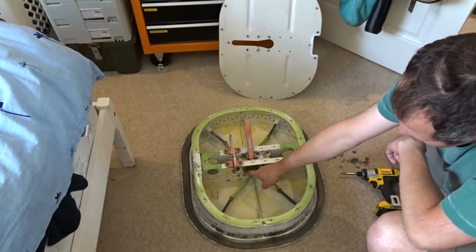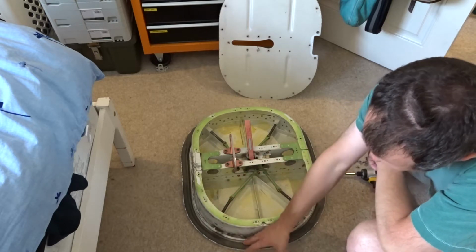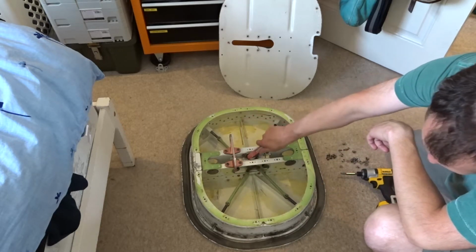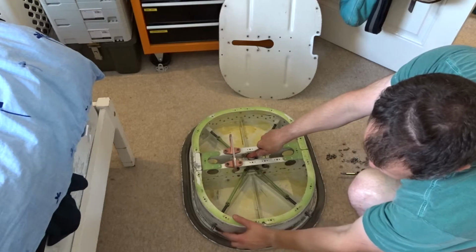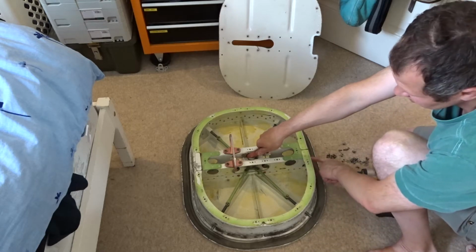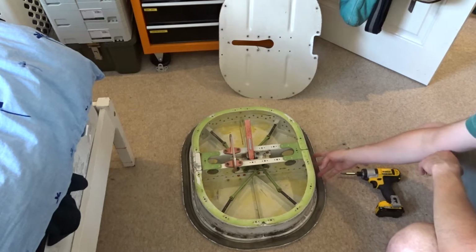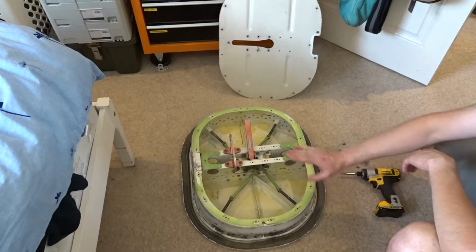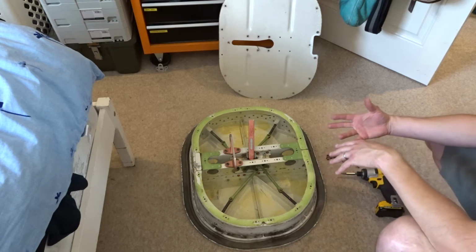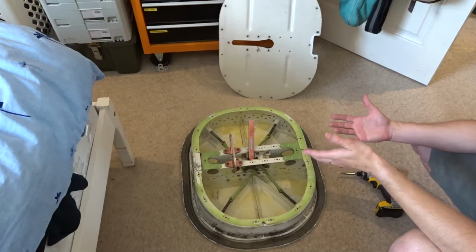It has a cog mechanism here which pulls on all of the 4 struts, and these struts are like safe doors. So once you've closed the actual door, the rubber seal will seal it. However, this will also go into the fuselage of the aircraft just for extra locking. In the past they didn't used to have that, they used to have a single catch, and unfortunately there've been a couple of aircraft accidents where the cargo door has been detached and has caused a decompression. So nowadays they have the full locking system as well as an internal suction system that sucks the doors in and pressurizes the cabin, including the cargo cabin.